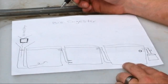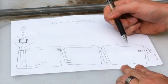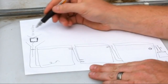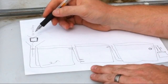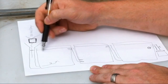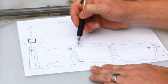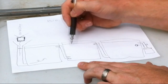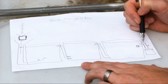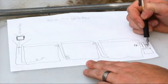This is our biodigester blueprint using three IBC totes. We wanted to build something that'll take a hundred pounds of food scraps a day, move it through, and the stuff that's been in there for a few days comes off the top and recirculates to the bottom. The stuff that's been in for a couple more weeks comes off the top again, and by the time it's fully digested it's almost completely eaten up and turned into a clear liquid we can use as fertilizer.